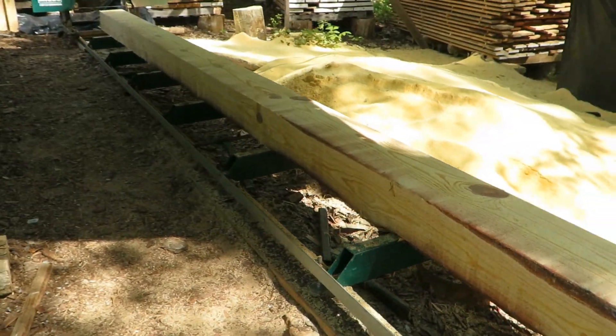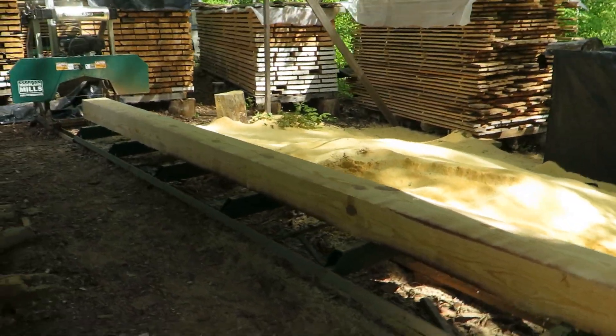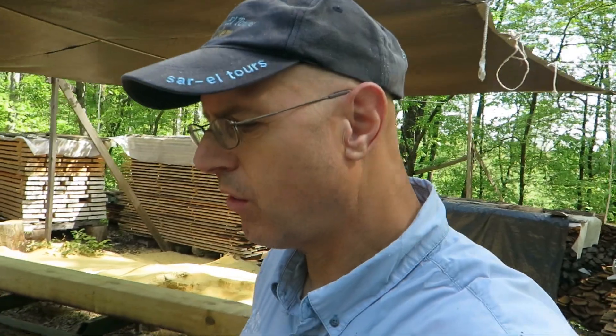In the loft area over the garage, it's going to be cathedral. It's going to go up in a 12-12 pitch. That means the slope itself is going to be the walls of the room, at least down to the floor level, and then there will be a collar tie for a flat ceiling up at 8 feet.